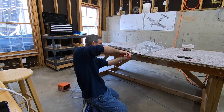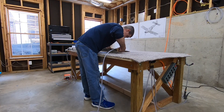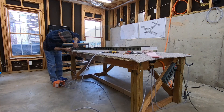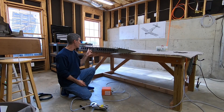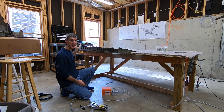Here I'm riveting the A and B parts of the top rib together. It takes a couple of blind rivets near the back and some 470s toward the front. Some of the 470s you need to buck, and some of the others you can get to with the squeezer. I've now riveted the spar to the shear clips, the top rib together and to the spar, and the bottom rib, control horn, and striker plates to the spar.